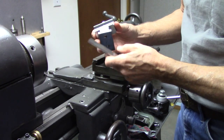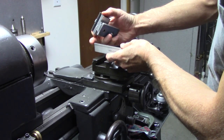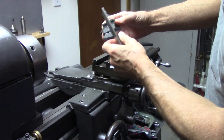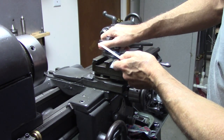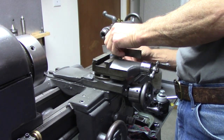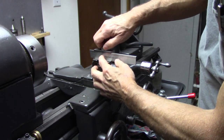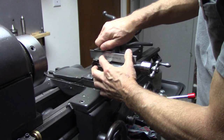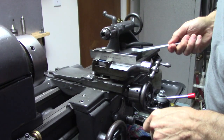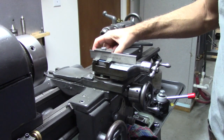This is what I came up with before. This tool is about the same height to center on my lathe, although it's very slightly low and I had to add a couple of shims there, which added to the complexity. But it mounts like this — when you lock it to your tool post, it also clamps down on the blade, holding it solid. That works really well, but I've got a new way to make this block to hold the blade.